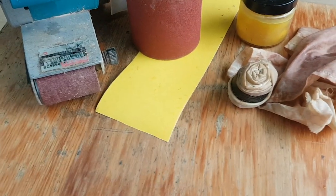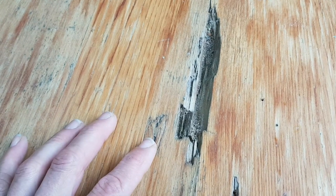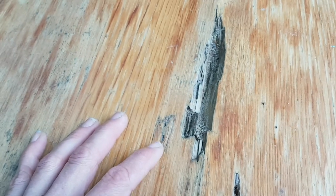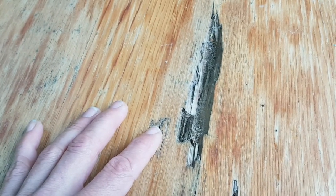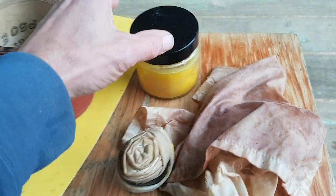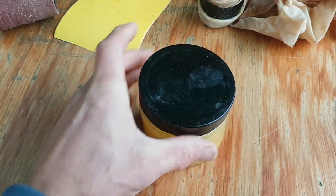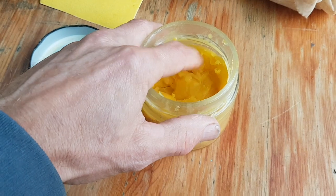Then I'll go to 120 grit over the top of that, and after that we'll just pour some straight beeswax in there and slice it off. Now the trick with slicing off that beeswax is you've really got to time it well — leave it too long and you'll have a lot of trouble cutting through it, go too early and you're going to pull it out and rough it up. Then we're going to finish it off with this beeswax-linseed oil mix, which is excellent for outdoor and indoor tables.